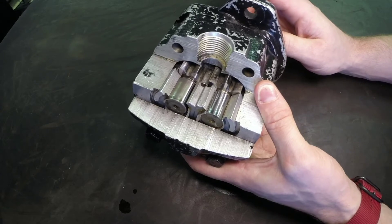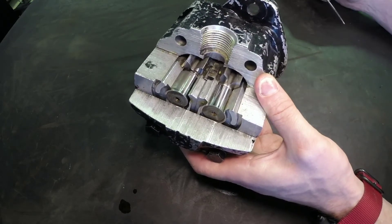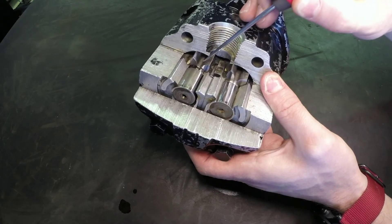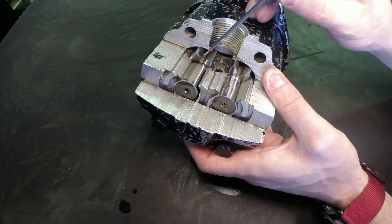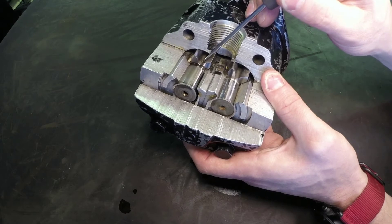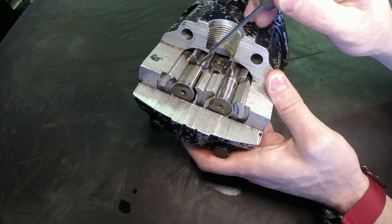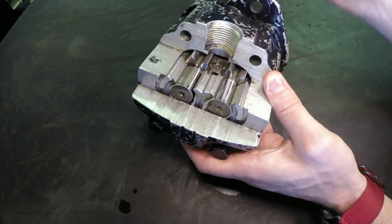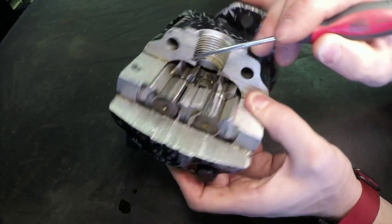From this design we can see that a gear pump is a uni-directional fixed displacement pump — the gear teeth move in one direction with one inlet and one outlet. It is fixed displacement because we cannot change the gear tooth pocket size. You may find external gear type pumps marketed as variable displacement, but really they just have multiple gear pumps where one is unloaded at a preset pressure — that is an unloader control, not true variable displacement. The displacement stays the same; it is fixed by the gear tooth size.